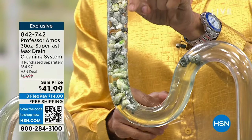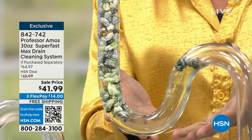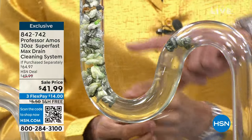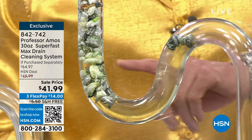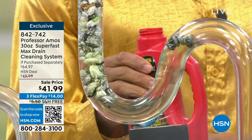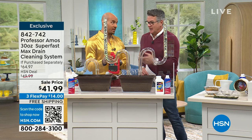Here's what's happening: 90% of those chemicals trickle, ooze, and creep right by the clog. This curved unit — the trap — is designed to hold fluids to keep odors from coming back up into your house, so the chemicals just well up right there in the trap, sitting there doing nothing. And in cold weather, this stuff gets hot and can crack your pipes.